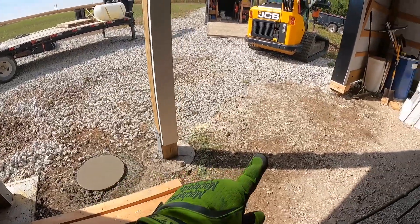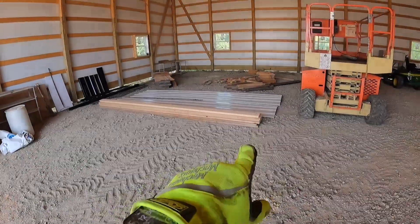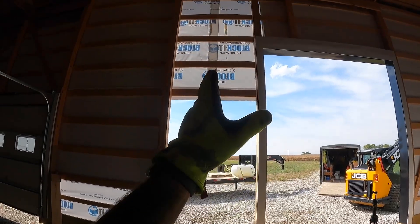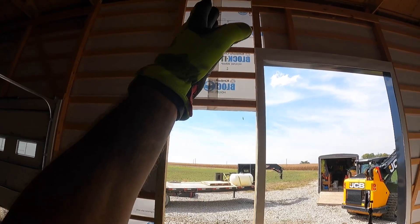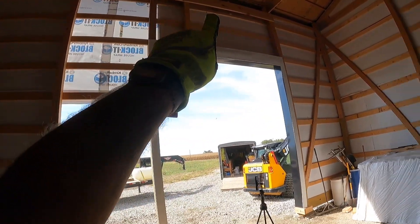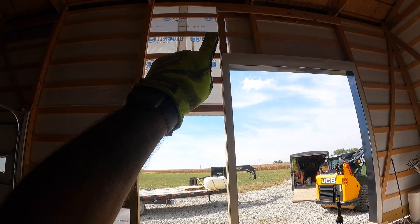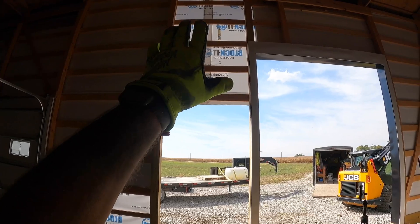It's two feet over, so that'll make this a 10-foot wide door into a 12-foot wide door. I have some 2x12 headers laying there. What I will do when I come back is bring my column, get it set up, nailed in, nice and plumb where I want it. Then I will run a header underneath that, and run a header underneath that 2x12 — it'll butt right up against it, get attached to the stub column and to the actual column.